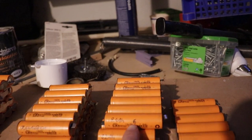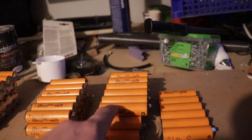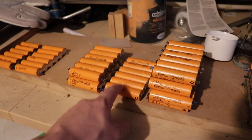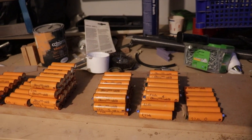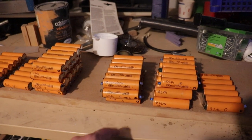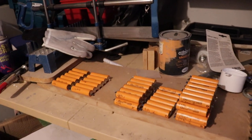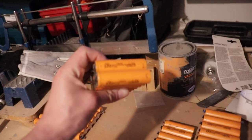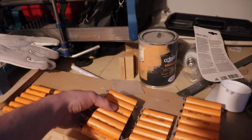And here we have a centre cell, number 6, coming out at 8.4 amp-hours. This cell has run significantly hotter than the one at 4 amp-hours, yet it's got towards the full capacity. We're just seeing similar things all around. There's a number 5 cell in the centre at 7.8. And they're really bad, guys — I don't think I have data on their position, sadly. No, these are just not labeled.